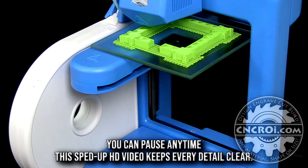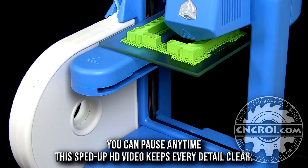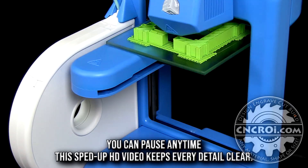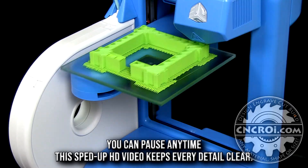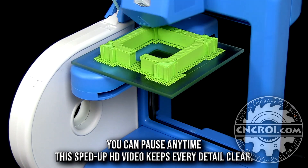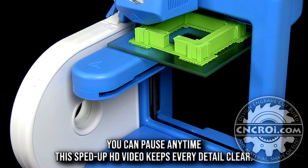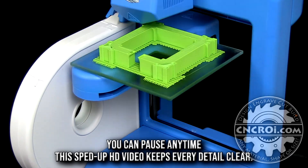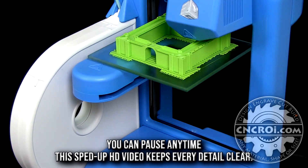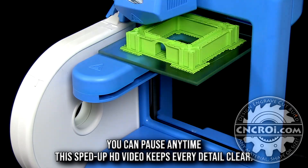It's actually impressive what I was able to do. If you look closely at the static pictures when I'm comparing the two models, you'll notice the archways were actually better 12 years ago with the 3D Systems Cube than with the Ender 3 today. I think the filament was thicker and had more strength to it, so it was able to go over gaps without problems. Nowadays the filament is so thin that there's not much strength through the PLA, and therefore if there's a small gap it just droops right down.